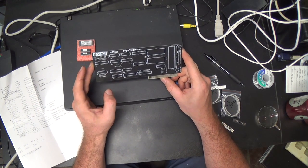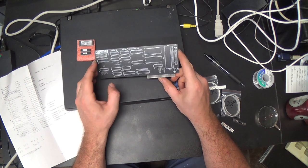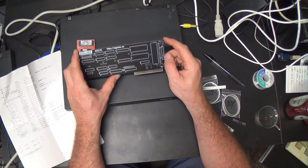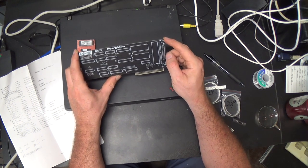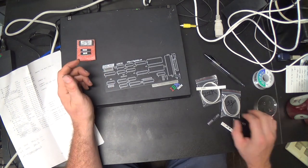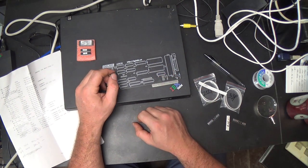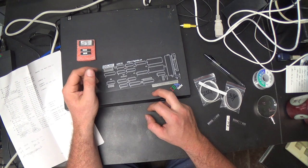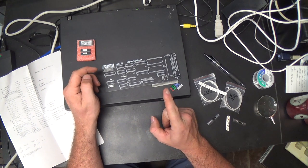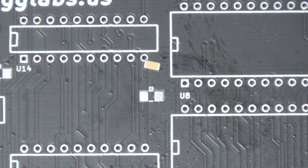Now, like I said, this is a copy of the Apple II SCSI card, but it does have some changes. They supply termination power through this little surface mount voltage regulator up here. They did something different on the original Apple card using some parts that are no longer available, so I think that's why he changed that. Solder all these resistors, surface mount resistors and capacitors on here, and I'm not going to film that because A, I suck at it, and B, I do curse occasionally, but if you hear all the cursing that I do while I'm soldering those on, my channel will probably get put in a restricted state, and we don't want that, do we? I don't know if this is right, but this is how I do it.